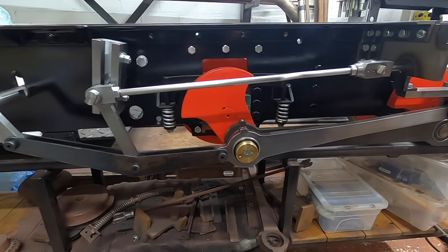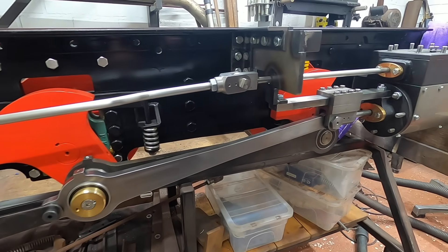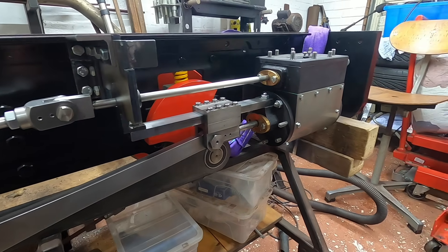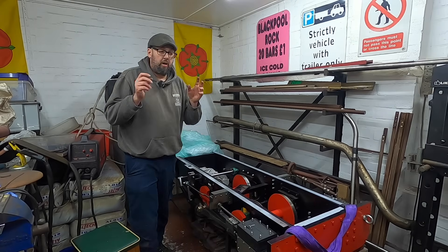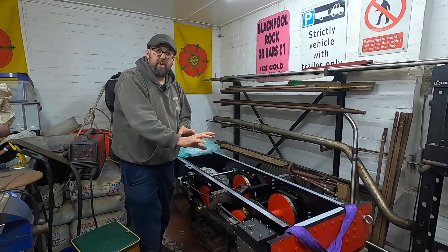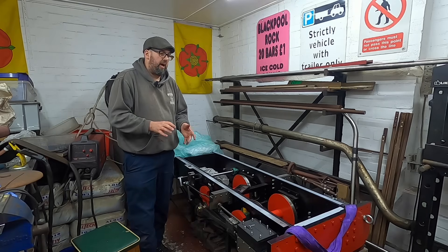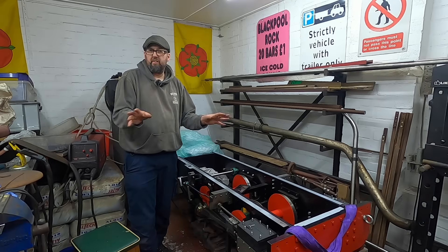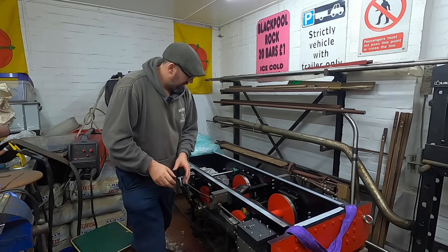As regards to the basic valve gear, we're done — we are complete. We've made all the pieces. We just have some fine tweaking to do — some little amendments here and some oilers to put on and whatnot. But before we start adjusting the valve gear into some form of correct positions and getting it running on air, we need a reverser and we need the pipework at the front end. We also need to start sealing up some of the cylinders, because there's a lot of air leaks going on and when we come to run it on air, the air is just going to escape through the fact that nothing is attached.